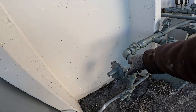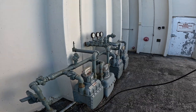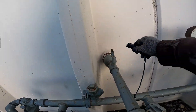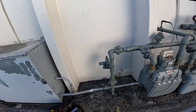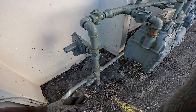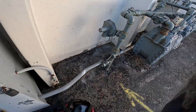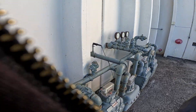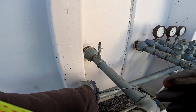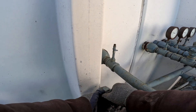Because the regulator is insulated, if you cannot get a good tone when grounding out back here, then the insulator is not properly insulating this service or riser. So what I'm doing is going behind the regulator to find a spot. Right here seems like a good spot. I unclip right here, ground right there, get my run lead, and put it right on the valve. I'm on the valve but I'm not getting any tone — so it's my grounding.